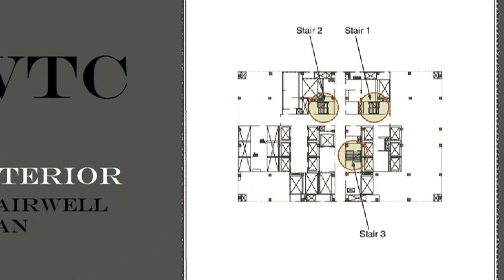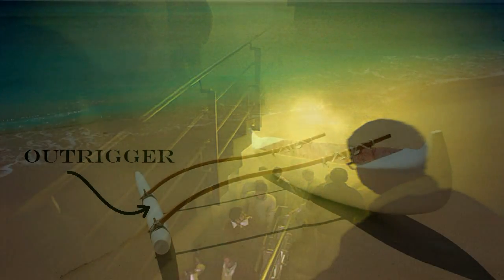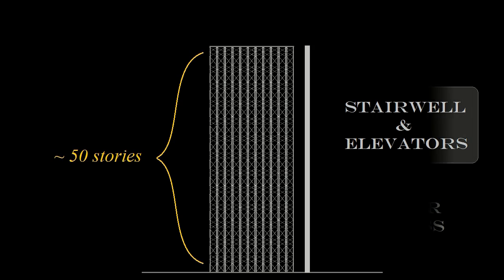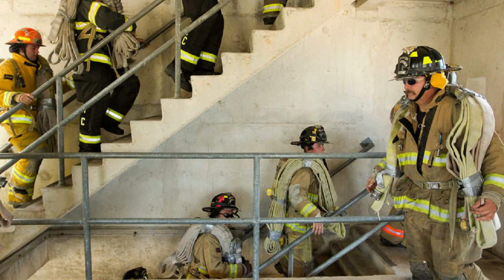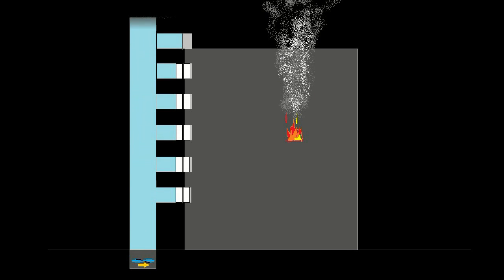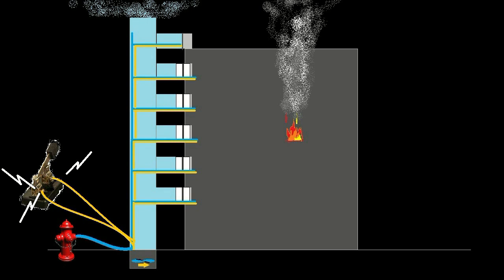Now we need a way to get to the floors of our building. Interior stairwells and elevators should never be used in tall buildings. These must be outriggered and have their own electrical and air circulation systems so that, in the event of a fire, they can still be used by people leaving and fire department personnel entering. The thought of firemen walking up 50 flights of stairs with 100-pound packs is totally unacceptable. If we put a large fan at the bottom of the stairwell, we can push fresh outside air up the stairwell and out the top, creating a slight positive overpressure, which, in conjunction with revolving doors at the entrance to each floor, would keep smoke out. The elevators remain operational because they are not involved in the fire. The electrical and water system for every floor would run up the elevator shaft to feed each floor and could be cut off or left on depending on circumstances.